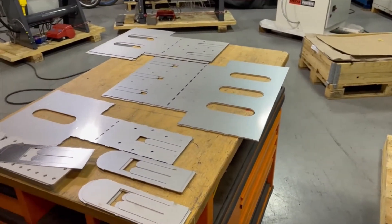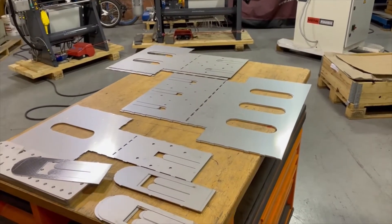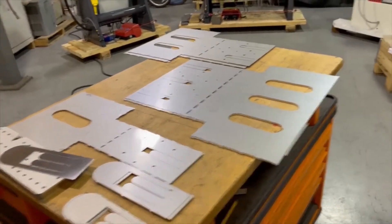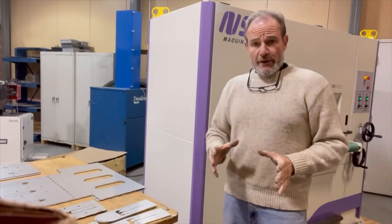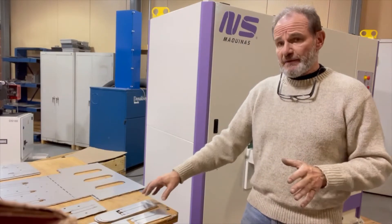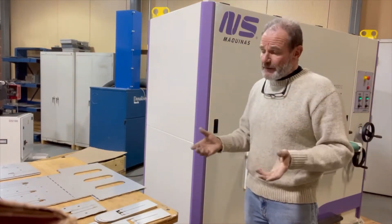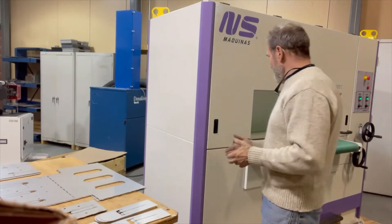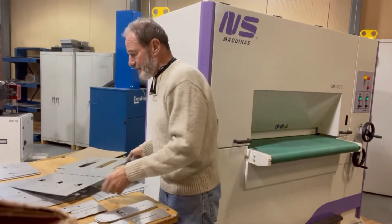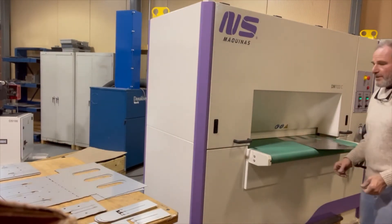The second thing I want to say is: because we have all these very similar materials, what I will do today is not run at different speeds — we will run them all at the same speed. I will demonstrate how quickly we can go through a few parts. There is 57 pounds of stainless steel here. What we're going to do today is run these parts in a micro-production and show you how fast it can switch between them. The machine is already turned on, set correctly with pressure and everything, and it is always an advantage to start with a larger part.